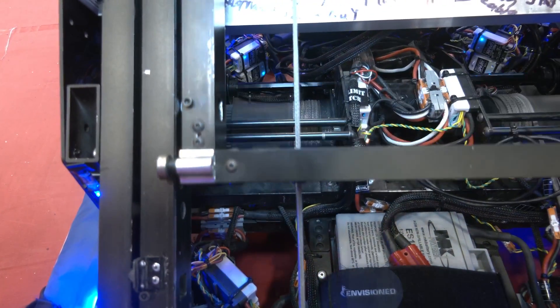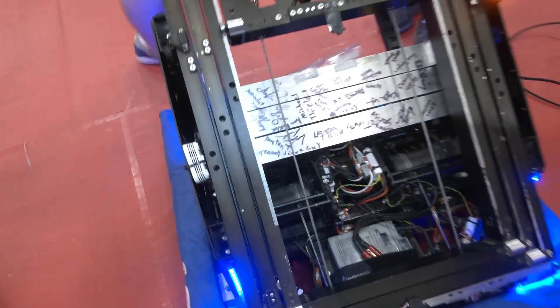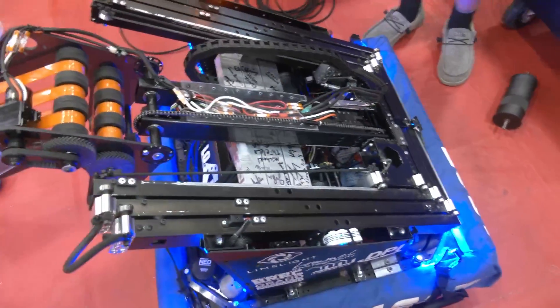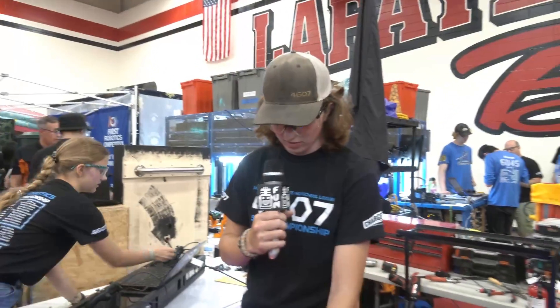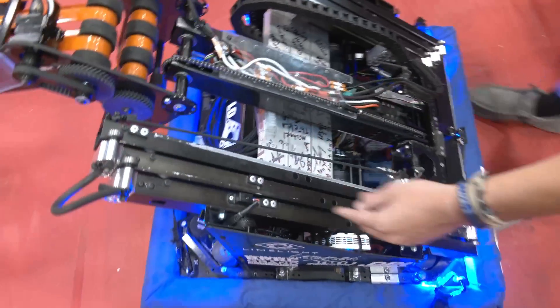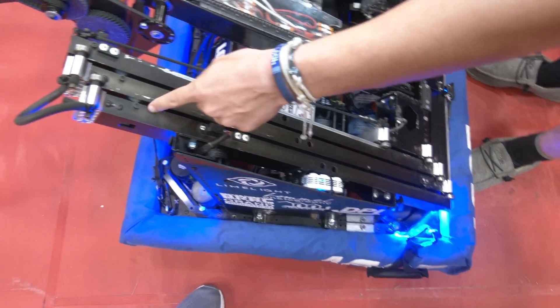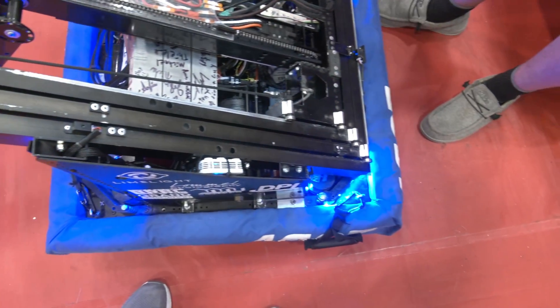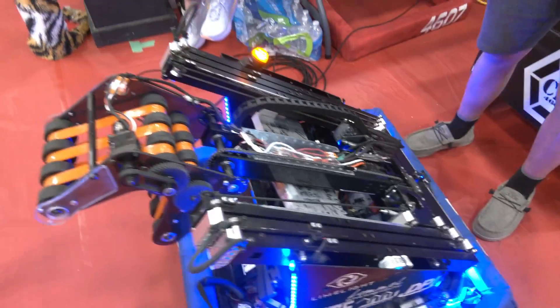I love the thought process that's gone into that — it's really cool to see, and obviously it's a very slick operation you've had as well. When you're looking at doing so much 3D printing, what advice do you have that other teams might benefit from? Just try new things and don't be afraid to see if it fails or not. We didn't think those gears or much of this would last very long, but it's actually proven to be way more durable than we thought initially. Now we plan to use it a lot more in the future. Going along with these drums for the rigging, a huge thing was keeping all of our rigging straight. The pull-up line comes up through here and it's all run in the tube. We actually offset the pulley so that the line is perfectly straight down the middle, which allows more predictability in programming so that fleet angle isn't changing the way it goes up.